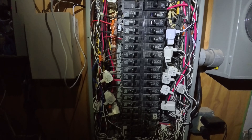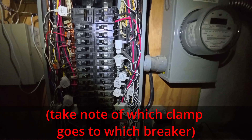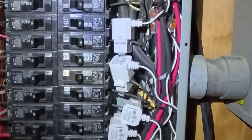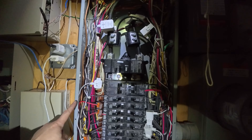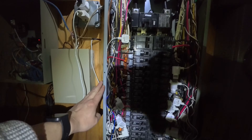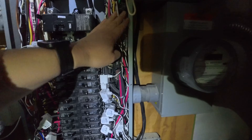These two wires are going down into the Emporia, labeled A and B. In the USA, we don't have the third phase, which is labeled C — just two cables, one and two. With 16 clamps in this kit, I connected every CT clamp to the circuit breakers that I'm interested in. Make sure that the orientation is correct — here you can see it's pointing to the left, and on the other side they are pointing to the right. Also, make sure that nothing is hitting the frame, otherwise when you close the panel you might pinch it.